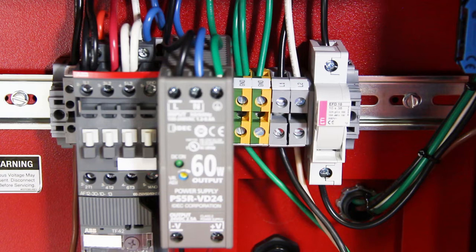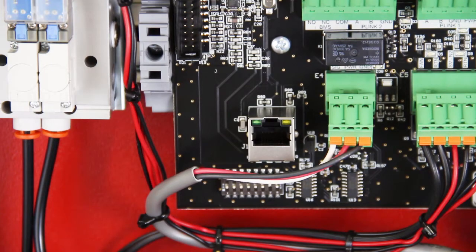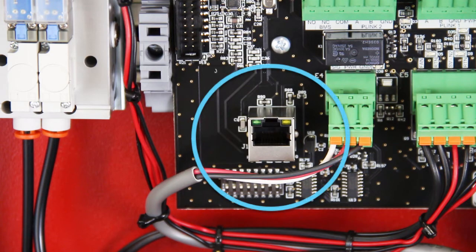All wiring should be performed by a licensed electrician and conformed to the NEC and all applicable local standards. For optional internet connectivity, wire a CAT5 ethernet cable using a half-inch knockout on the back of the cabinet to the ethernet port on the intelligent controller on the inside of the nitrogen cabinet.